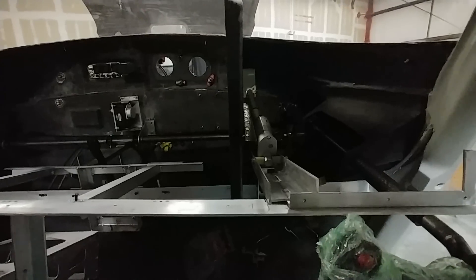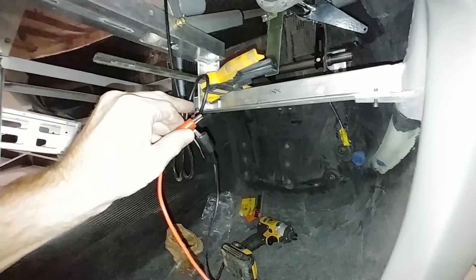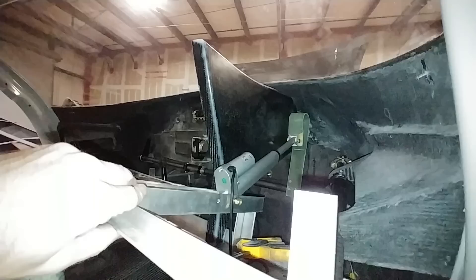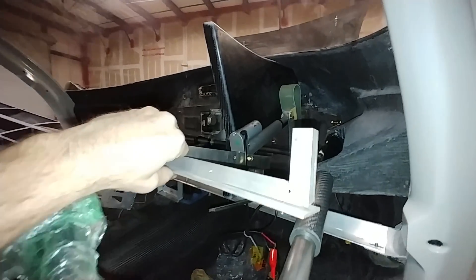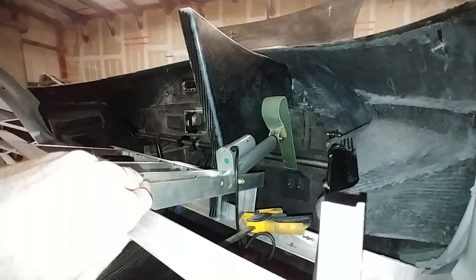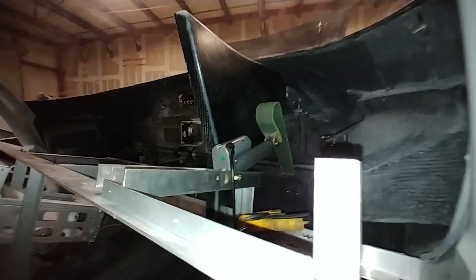I've got the actuator actually working here — just hooking some power up to it so you can see what happens. When I hook power up to the linear actuator it pulls the stick back out, basically affecting a nose-up attitude trim. You can see it slowly moving, pulling inwards and pushing the stick out towards the camera. The trim is actuated by the hat switch on the side stick, and the spring is there so you can fight it a little bit like normal trim, but overall it'll hold wherever you set the trim to be.